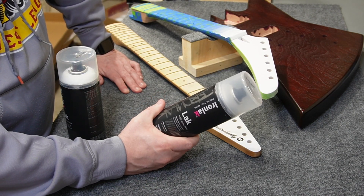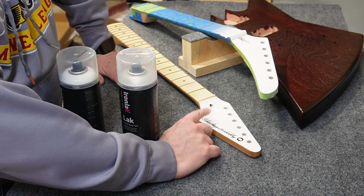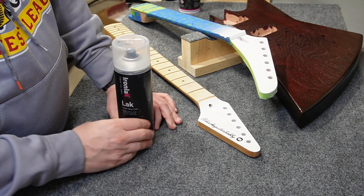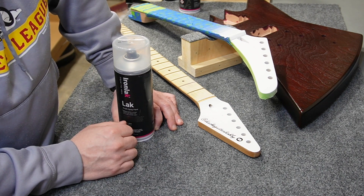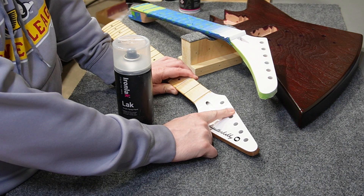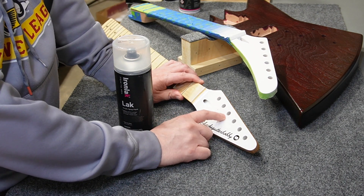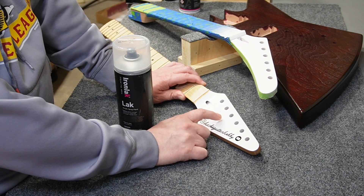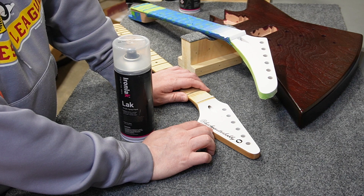I'm going to have to go with several coats of this. I think this version of the headstock has at least three on it, but I'll definitely need more in order to bury that logo. With this stuff, the water slide decal kind of melts in, which is one thing I was really looking for. The one thing I will say about these lacquers is they take a long time to fully cure — not between coats, because you can recoat in probably an hour. But if you don't let them cure sufficiently, you'll notice when you put your tuners on or start to sand that they're a little soft in certain places. I actually put one of the tuners on after about a day, and it already started crinkling up around the washer. So you have to be careful to let them really fully cure before applying any hardware.